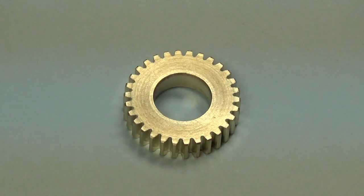the rotary table. Like I said, this gear was a 30-tooth gear, and 30 teeth or 45 teeth or 90 teeth is going to be easy to make by just cranking the thing to the same point each time. But any odd number of teeth and unusual combinations that's not divisible into 90 is going to require a certain number of rotations plus a certain number of degrees, and that'd be just about impossible to do by hand, especially when you're going to make a lot of gears.